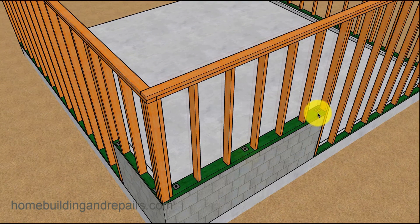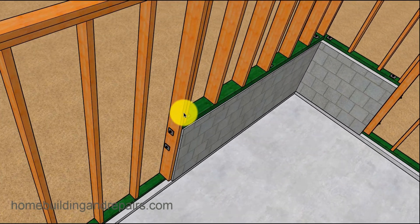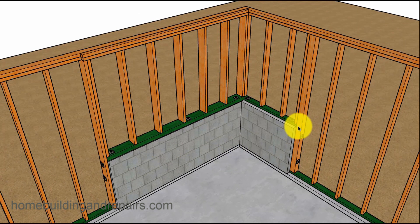Here we have 2x4 framing; you could always switch it to 2x6 to make it a little stronger, then put a filler piece on top to create a nice corner for the top plates — especially if you're going to drywall the inside of the garage or finish it. You could also install 2x6s next to your original 2x4s. If the original framing was 2x4, you could install a 2x6 on the other side without removing it. Think about making it stronger using 4x4s or 4x6s at points where there is going to be a hinge point problem.